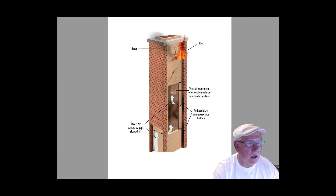That's all I'm seeing. We also talked about the damper. Remember, these are vented gas logs. Vented gas logs means the damper must be blocked open 24/7, rendering the damper useless. So as long as the damper can be opened and blocked open, you don't have to worry about the damper. Now if you switch over to wood burning and there is a damper issue, a new damper could be installed.